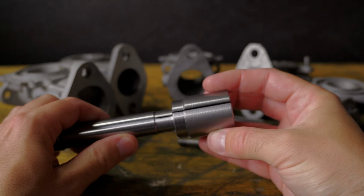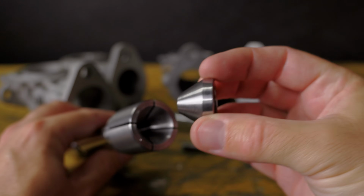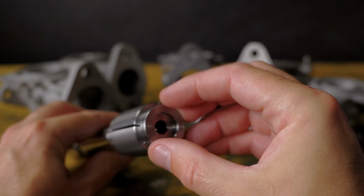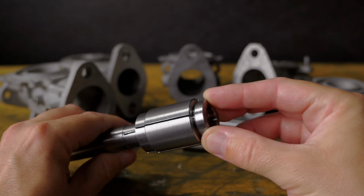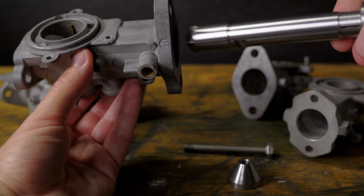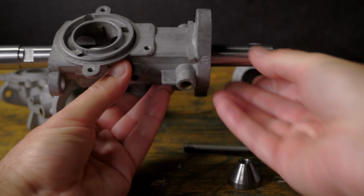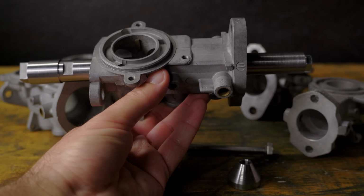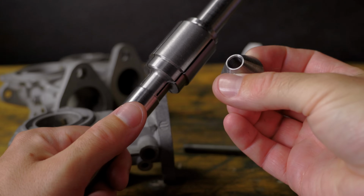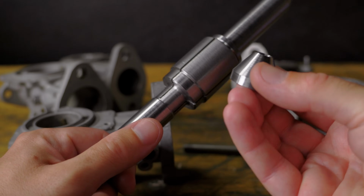from the bore. This head is dimensionally very close to the size of the bore, and once this cap is pushed into this taper, the jaws will expand and grab the part. I can either use the tool this way, or this way, and I can drive it between centers, or with a chuck and a live center in the tailstock. These 2 caps are a bit redundant, but I don't know.